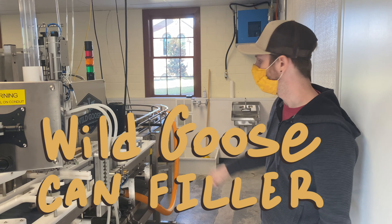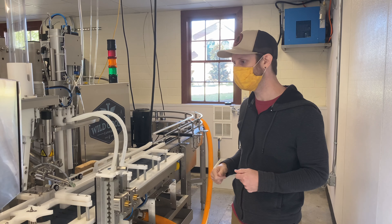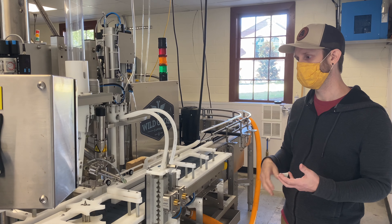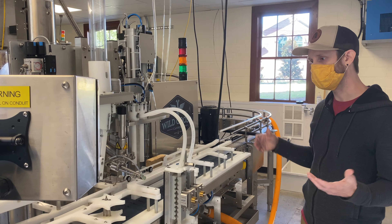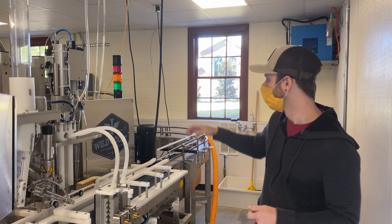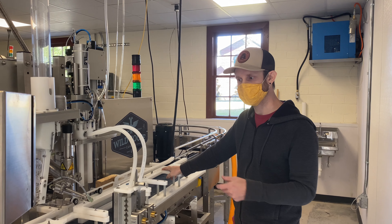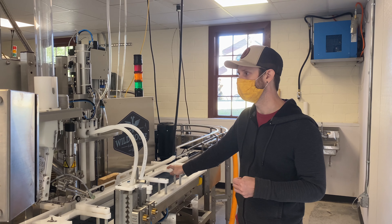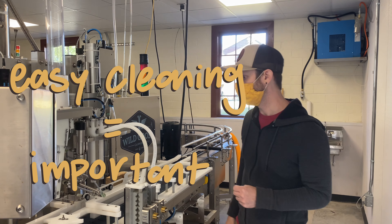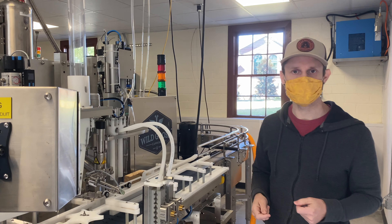This can filler is called a Wild Goose. I love this machine. It's not a hundred percent fully automated like the 'How It's Made' videos — there's still some user interface involved. I have to control levels and how much brew goes into each individual can, but once it's set, the pressure is consistent, it takes care of itself, and we lay out the cans at the end. This machine is made from all food-grade plastics and is all pneumatic except for the conveyor and the seamer, so it's easy to clean — which is really important. You don't have to worry about any porous areas where bacteria could pass through.